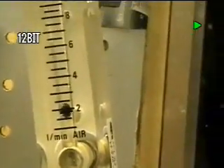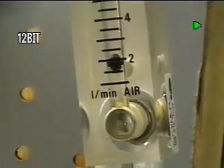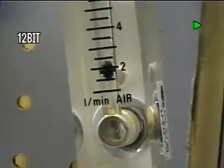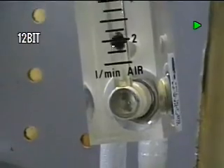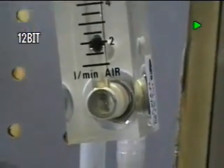Of course, our gas is pulsating and it's staying right there — pulsating — and we're at the 2 liters a minute, 1 and a half to 2 and a quarter liters a minute, at only 5 amps, 13 volts, with an outbound gas temperature around 90 degrees, and the canister temperature in the upper 80s.